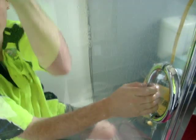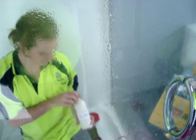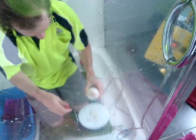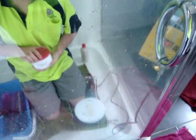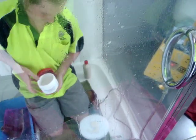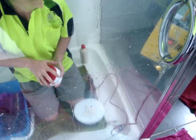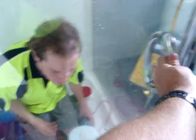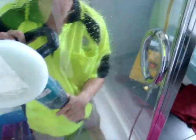So we just wet the surface first and do a little test area here. We've got a pad and a mix of product — we use a drawing paste, which is a product only available to our technicians. You can't buy the equivalent of this product from us. We do a dulled-down version over the internet. We're applying some honing powder there as well, with a glass-friendly pad. Now Matt's going to put this onto the glass and restore a section probably two or three times the size of that pad.